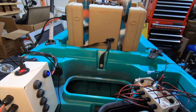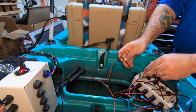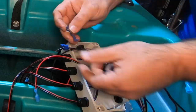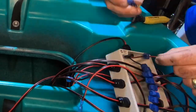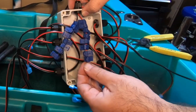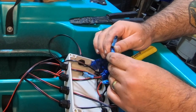Inside the box, we're going to use T-connectors on the line that provides main feed power. Feed each light wire through one of the glands, split the wire, then crimp on blade connectors — make sure your connectors are properly sized for the gauge of wire you're using. Push in your main feed wire, ensuring it's long enough to reach your switching box with enough slack to pull the junction box out of the hull if you ever need to work on it. Clamp down the gland to keep the wire from slipping out, then split the positive and negative wires. I found it helpful to alternate the T-connector directions — two to the left, two to the right, and repeat up the chain. Seal off the wire ends with wire caps, then plug the blades into the T-connectors. If your blades aren't centered after crimping, bend them into place with a flat-bladed screwdriver. Remember: red to red and black to black.